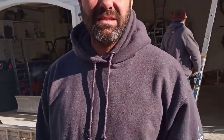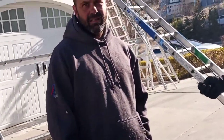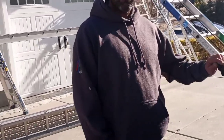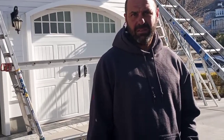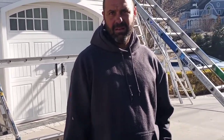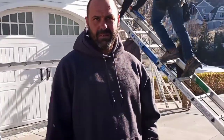will seal it. And if it's a bigger thing, if there's a hole that you have to drill under a shingle, use caulking to hold the shingle down and caulking in the hole. Bryan once said to pull the wire in and out of the hole to pull the caulking into the hole. Yes, seal it on the inside.